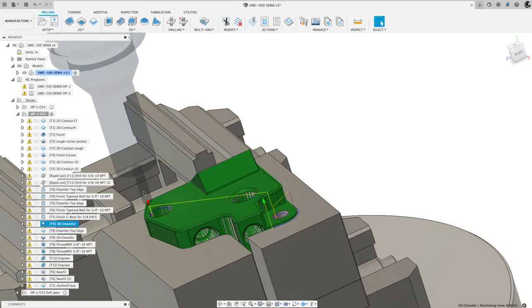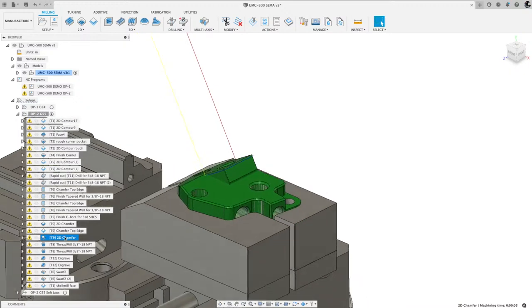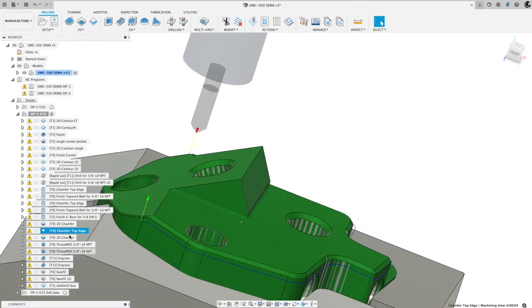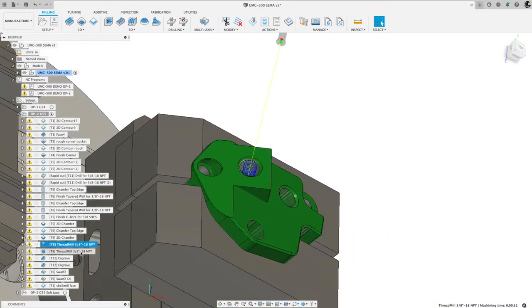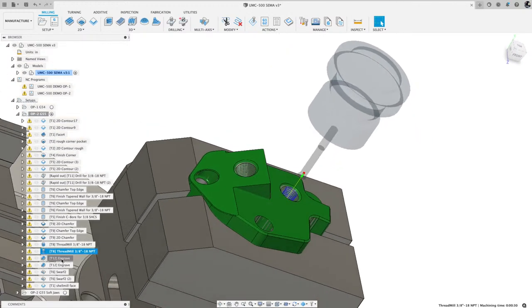And just carrying on, I did some deburring, chamfer mill. So that was a big chamfer there. This guy was that big chamfer edge there. I deburred this top edge here. Next, I did a thread mill here because I already bored those. I chamfered it. I did the chamfered face and then the bore. Now these two will do the threading. Then I did some engraving.